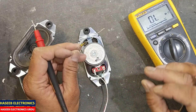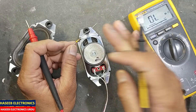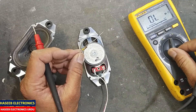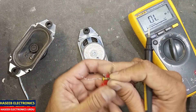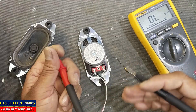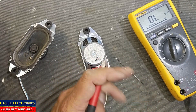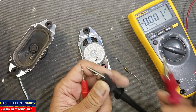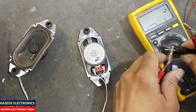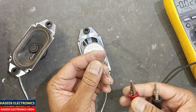Now we will check its performance — when we apply an audio power signal, will it move properly and generate a proper sound? For that purpose I am using a 6 ohm resistance in series. You can use 5 ohm to 22 ohms. That is a good way. I will also use a 10 volt signal and connect this resistance in series with the voltage.